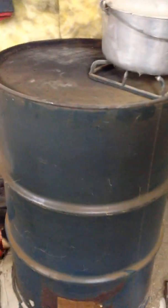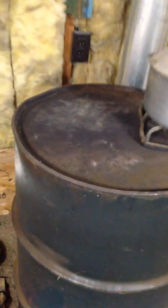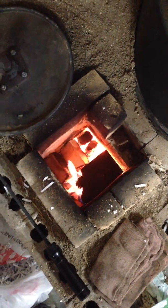This flue pipe I got running through this sand is at the bottom — it comes down here, goes back around this way, and comes back up. I think it would have been better if I'd made two layers, had two runs of it through the bottom, put some sand in, then bring it back down and back around again and then out. That way it would heat the mass up a lot quicker. But you can cook on it, and it does a pretty good job here in the shop. Burns a lot less wood than a regular wood heater.